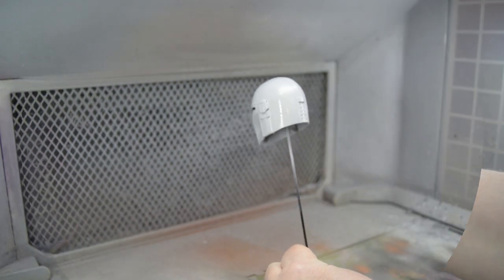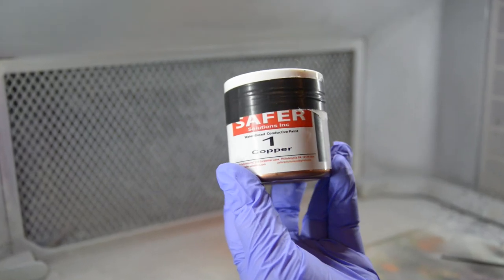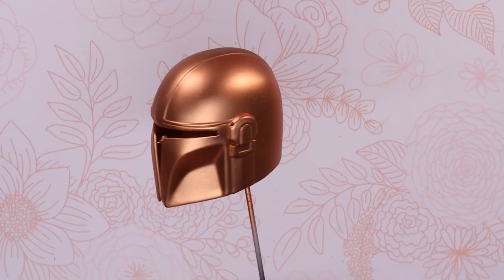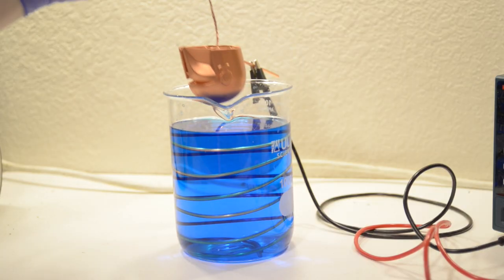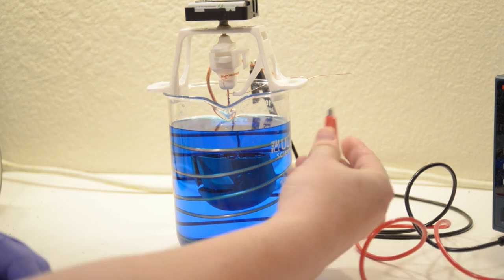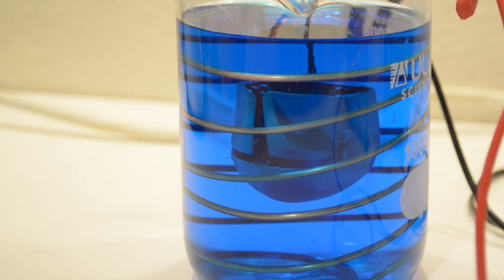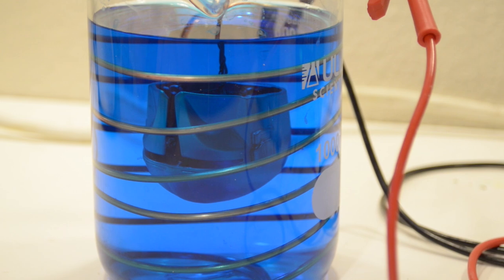The first steps are to get the smoothest print surface you can. We did this by spraying different levels of Mr. Surfacer and sanding between coats. Then I airbrushed two coats of copper conductive paint. Once that's dry, we submerged it into an electrolyte solution with a copper wire anode and thinner copper wire to go to our electrical cables. Then, using a rectifier, we sent a current into the solution. This essentially creates a reaction that makes copper molecules jump from the thicker copper wire to our 3D print.